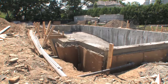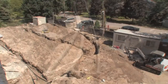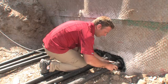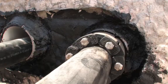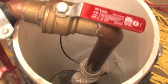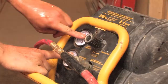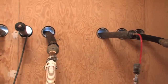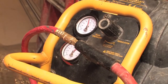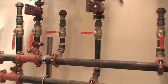The residential buildings are treated the same way. Once all vertical pipes have been connected to the horizontal pipes, the network is complete and can be brought into the building. A special collar is used to provide a sealed barrier where the pipes enter through the basement walls. A flush test is done using a high pressure pump to clean any debris from the loop and remove any air in the lines. The entire system is then pressurized to 120 PSI and left for 24 hours. Once the network has passed inspection, the incoming and outgoing pipes will be connected to the interior heating and cooling piping system that supplies the home.